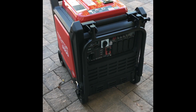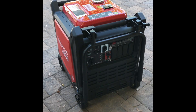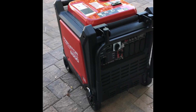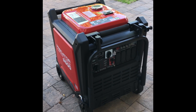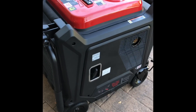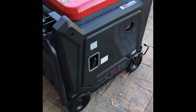We're going to do a quick overview on the new Harbor Freight Predator 9500 watt inverter generator. I got it out of the box and I've run it for about an hour so far. I used the Pennzoil 10W-30 oil that they sell at Harbor Freight for the break-in. It runs great and starts right up. After the break-in as recommended in the manual, we're going to switch over to a 10W-30 full synthetic from Honda.